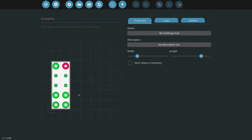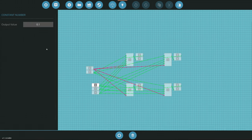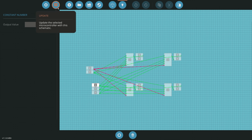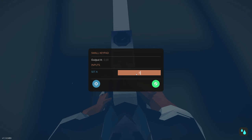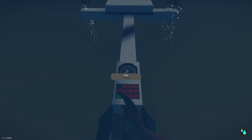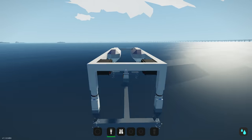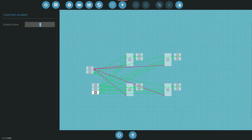Let's go back into the controller and customize the PID again. I think we should add a whole bunch more dampening — let's leave the speed as it is and try adjusting the correction rate. More dampening so it adjusts and slows itself down a little bit. Let's set ourselves to negative five again and turn it on.